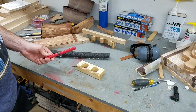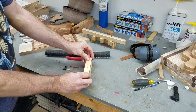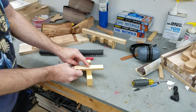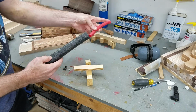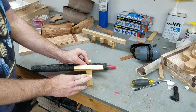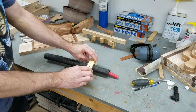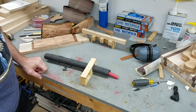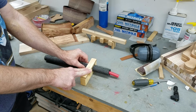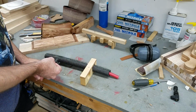So to solve both problems, I put together this little device, which allows you to put a screw in there, turn it open, and feed your pipe and your insulation together through this device. You can run your hot, you can run your cold, and then you turn this jobby here and it closes your pipe in there, and that ensures that your pipe has continuous insulation for the entire length, and also that isn't going to break like a little plastic clip will.